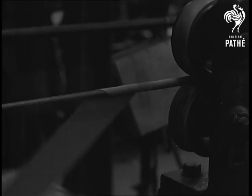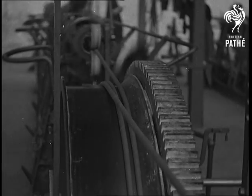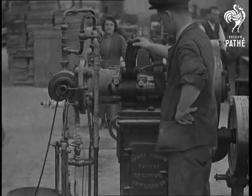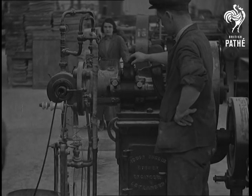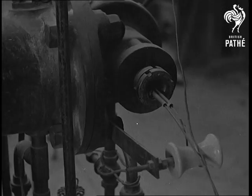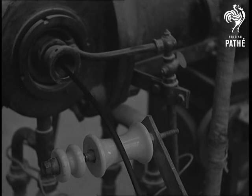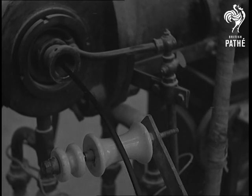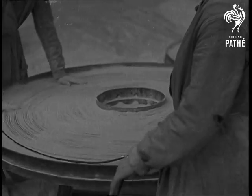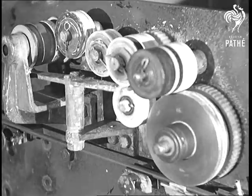These larger cables are used for main cables for motors and transformers and for service cables. Another type of cable, used for instance for house wiring, is covered with a tough rubber sheath. This tough rubber sheath without seam is extruded by pressure over the cable. The girls are laying rubber cable in the tray, ready for vulcanizing. After vulcanization, tough rubber sheath cables have the maker's name and grade of cable printed on the surface.